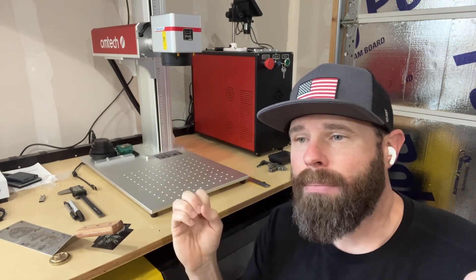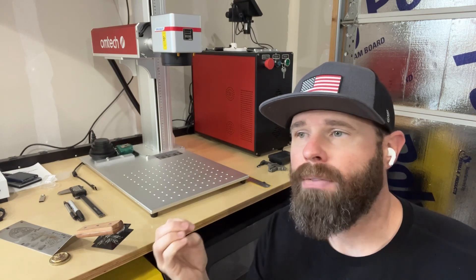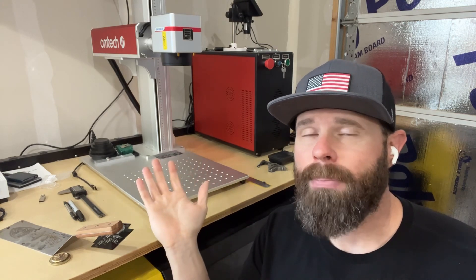That's the recap — those are some of the projects I've done on this new machine. I just wanted to give you an update on what I think. Honestly, the 100 watt machine compared to the 30 watt machine — I'm improving my times, and with it being a MOPA, I'm getting more features. I'm able to vary that pulse width and get some different results on stainless steel. So all in all, I'm super happy. I'm glad I got the 100 watt and it's been a great addition. Stay tuned for more videos. If this one was helpful and you liked seeing the updates, make sure you subscribe and like it so others can see it, and we will see you on the next one. Thanks everybody.